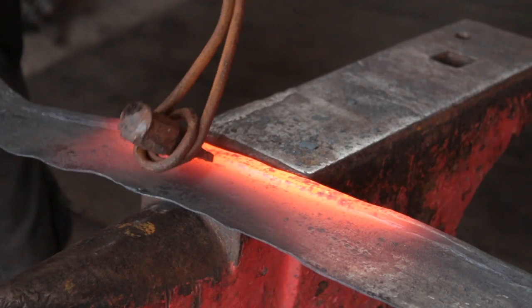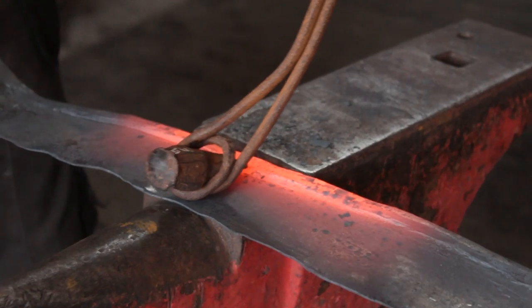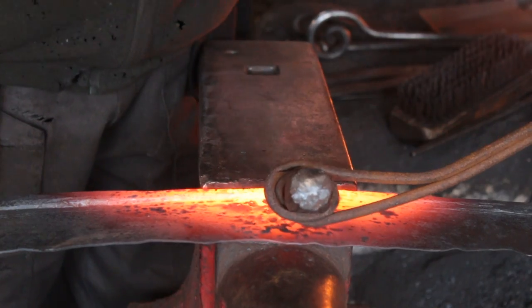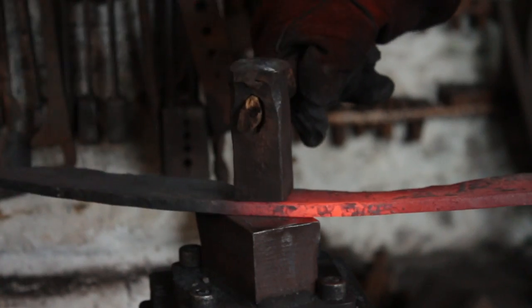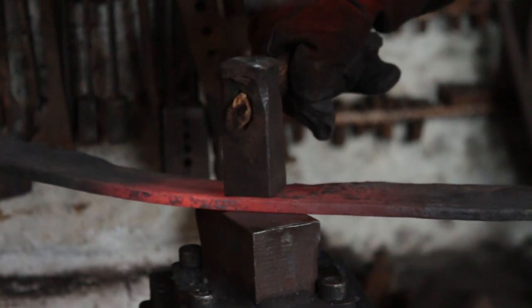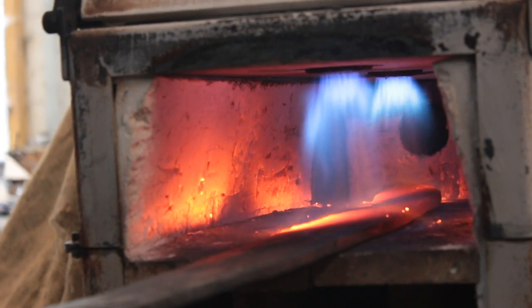At this stage I'll go to the cutting plate on the anvil and just rest the spine of the scythe against it, then go in with a small butcher to square that up some more — it'll put a bit of an undercut underneath, which is fine. Then square up again with the set hammer. At this stage I had to go back and forth between the two. I also decided to switch to the gas forge for this last bit, which puts a longer heat on things, meaning I can do a bit more work in one stretch.